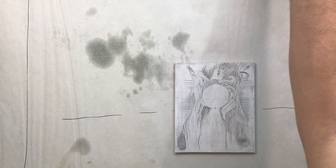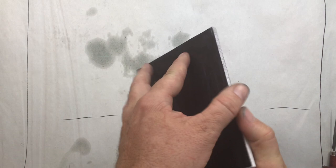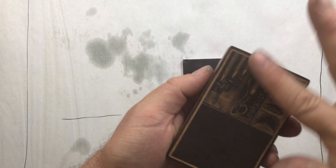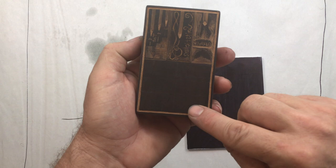For this demo, I'm going to do some engraving into the backside of this high impact polystyrene, this HIPS board. It comes white like PVC, and what I've done here is I've sharpied it into black. Traditionally you'll see people working on wood stain the wood a dark walnut color, or a thin coat of black, so that you can see the wood through it. I can see the pencil drawing on this pretty easily.